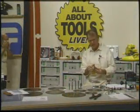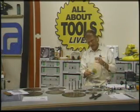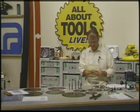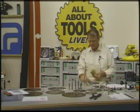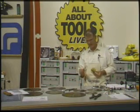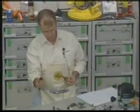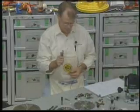If your shank is not a sufficient thickness, it won't retain the rigidity that it needs, and you won't be able to get the cut. And the cut is critical, especially in high abrasive solid surface materials. So the rigidity is the key on any router bit. If you don't maintain the rigidity, you'll get a very poor cut, which will introduce a lot of stress into the collet, which will wear your collet out and will ruin your bit, and it's costing you a lot of money. So rigidity is really a key.